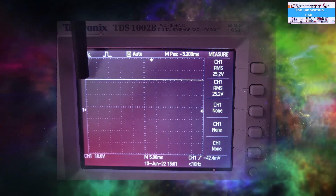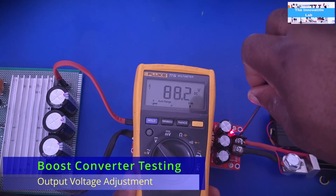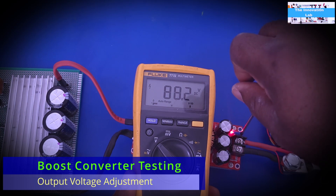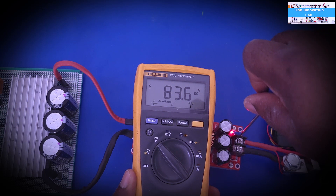As you can see, we have a very clean DC output to feed into our DC to DC boost converter. We got to 88.2 volts DC — that's the highest we can go. With this, you can charge up to an 80 volt battery. This shows that it works. The only limitation is that we cannot really charge any battery below 24 volts, so for that we may have to use a lower voltage transformer.